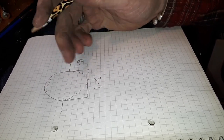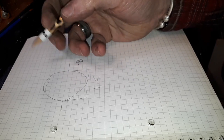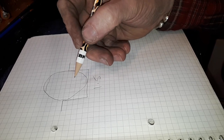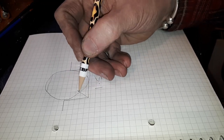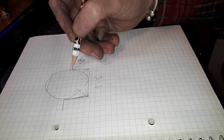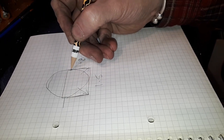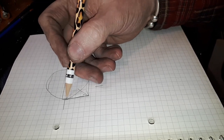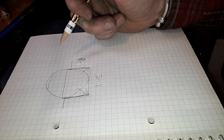by tapping it on the top, the silver is very soft. It's annealed wire. If you haven't got annealed wire, then basically you just heat it up to just red and then let it cool. So what we do, we'll beat it in and it'll move right to these corners and be tight into these slots. It will stand a little proud when you've done it, and that gives you something to polish off. I'll be soldering the joints and that'll keep it permanent.